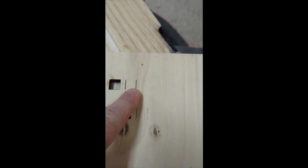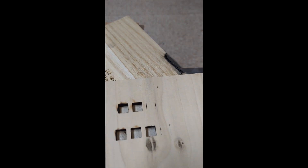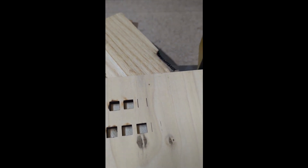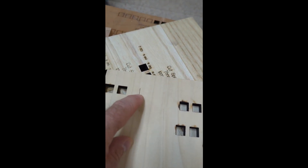You can see on the backs of these where the next speed up would cut through on one axis but not the other — that's pretty typical for diode lasers. The beams aren't perfectly symmetrical, so they're a little bit hotter in one direction than the other. This is what it looks like once you go just a little bit faster and it can't quite make it through.